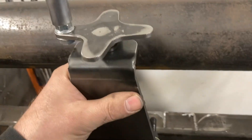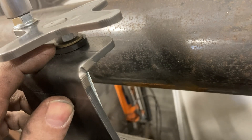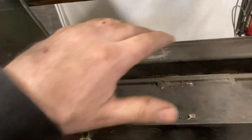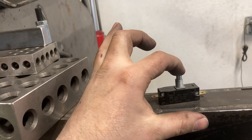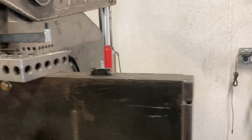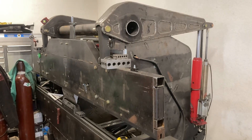I'm pretty excited about this. This all rides on bushings that are pre-loaded pretty snug with no backlash. In the regular threads and coupler nut there's a tiny bit, but there's a lot of weight on these arms, so it's going to want to fall to the bottom. The only load on the arms is just what it takes to click the switch — about an ounce — so the weight alone should click them without putting any stress on the adjuster.